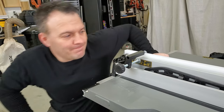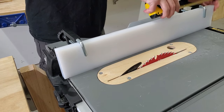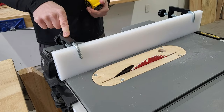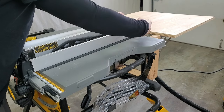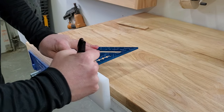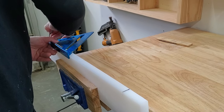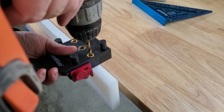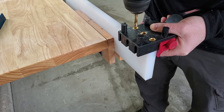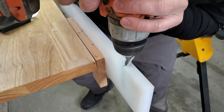That is perfect. With the fence clamps installed, I figured out that I need to drill dowel holes about two and a half inches from each end. By the way, these are called fence clamps and you can get these on Amazon — I left a link in the video description. First I drilled quarter inch dowel holes and then I enlarged the holes to the final size using the smaller holes as a guide.